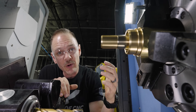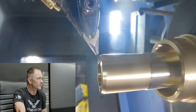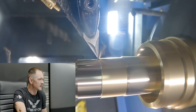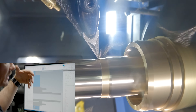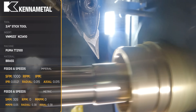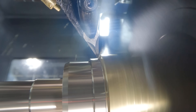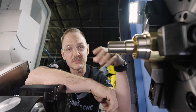With that feature done, we're going to finish and cut the OD. I'll come across the base, turn down diameter A, wrap it out, come down and cut diameter B, then cut the other two diameters. Because I already turned that 0.950 diameter with my groove tool, I don't need to cut it again with my finish tool.